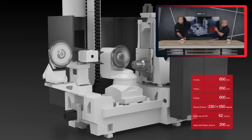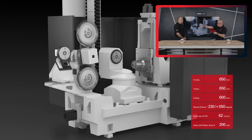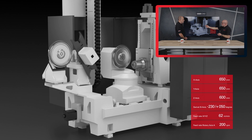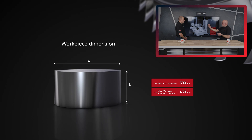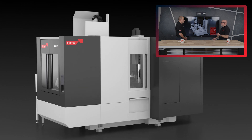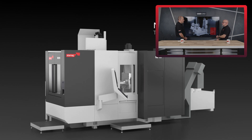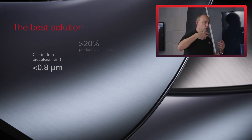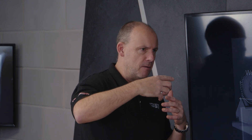What sort of machine would you use — what are we seeing here that you offer? What you're seeing here is a machine configuration that's been designed specifically for blisks. From an automation point of view you've got a spare pallet and a component loader, and from the working side of the machine a horizontal spindle, a very dynamic two-axis system to hold the blisks so that we can rotate and orientate them. The bigger the blades, the longer the tool you need — more opportunity for vibration and issues with surface finish.